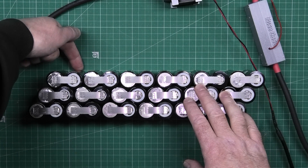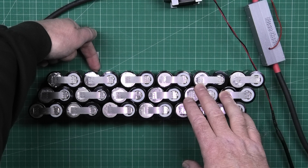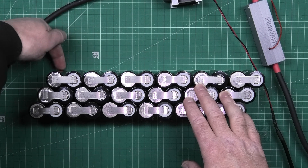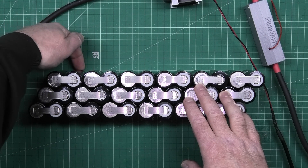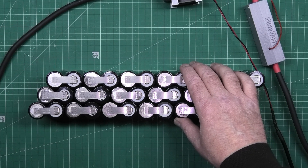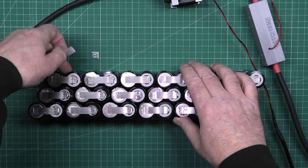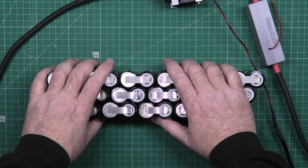On the other side, I've got to put the negative on that one to the positive on that one, and then go from the negative on that one to the positive on that one. If you were to accidentally short those two across, even for a brief second, you'll knacker one or both of those cells — the nickel will just completely fuse it. So you've got to be bloody careful.